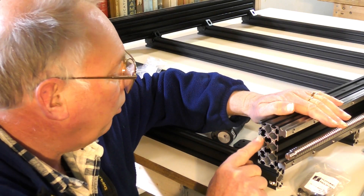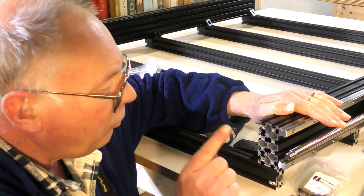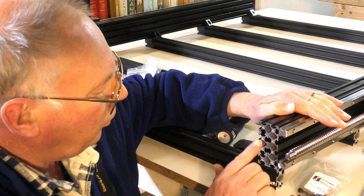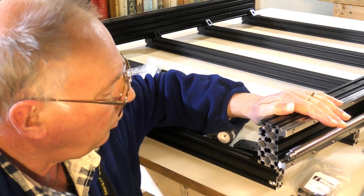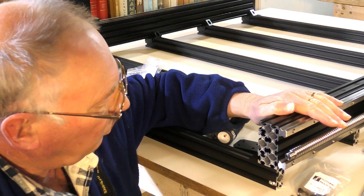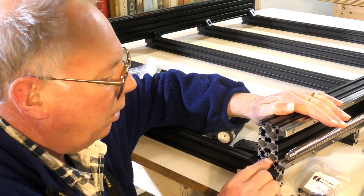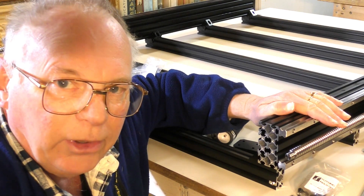This should be flush. So I'm going to have to remove both of these now and get them on my big sander and just sand off the end — just that 0.6 of a millimetre — to get them to fit flush on here. It would be preferable to be a little bit less than being protruded, but it's easy fixed.